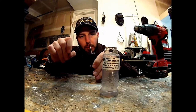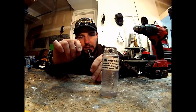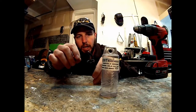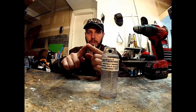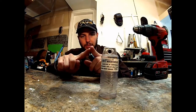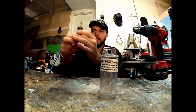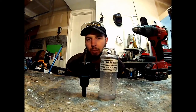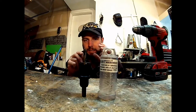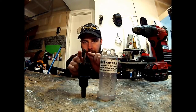It's very hard to see, but one of the things that sets this drill bit apart from the other ones is the carbide actually has different points. It's actually ground like this in the middle on some of them — it's not just a flat square chisel piece. It's ground like this in the middle, and then the next one over has a point on the end, and then the next one over has a point on this end. That is one of the things that sets this particular annular cutter apart from a bunch of the other ones that are on the market right now.